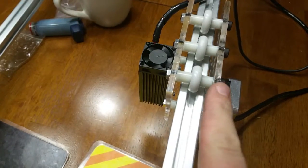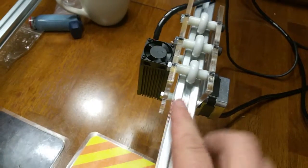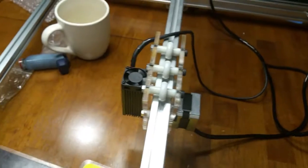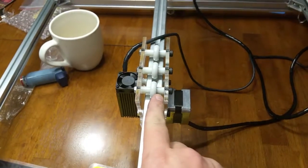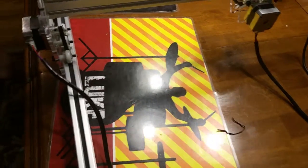Let me show you the areas where I had to unbuild and rebuild because the instructions didn't tell me clearly. First, on your X carriage, there are 10mm and 12mm wide spacers. On the side closest to the laser, you want to use the longer spacers — you'll know it when you see them. That's three here and two down here using the longer ones. For the Y carriages, you're going to use all 10mm spacers.